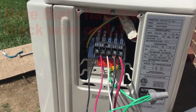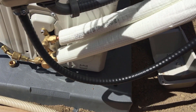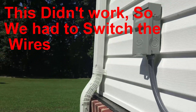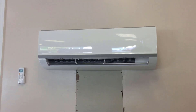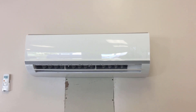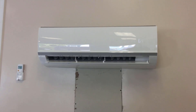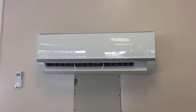Notice the black communication cable here that goes to the evaporator indoor unit, and this one is your main cable going to the pull-out like a standard air conditioner. We got it running — it runs just beautiful. Just a note: the line set is made for 25 feet. If you have to make it shorter than that, you'll have to adjust the charge, but if you can leave the line set intact then you won't have to mess with the charge.